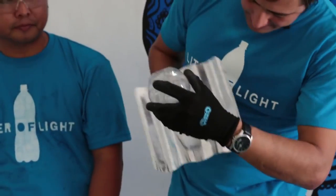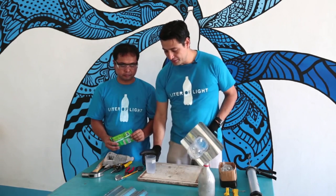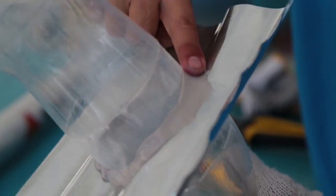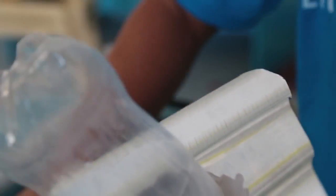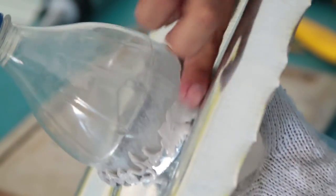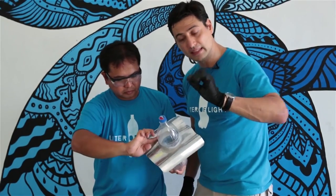As you squeeze in the bottle, make sure by putting glue beforehand that it goes in between the metal sheet, lessening the risk of leak. So that your fingers don't stick to the glue, the best thing to do is to mix some water with some soap. Try to push in the glue as much as possible into all the crevices. This is very important so that if the upper seal is breached, you still have a very good one on the bottom to hold back water from coming in. Do the same for the top.